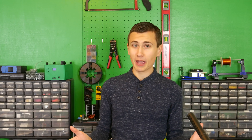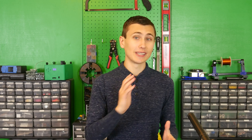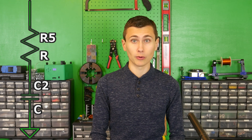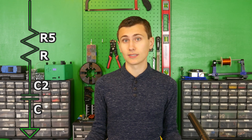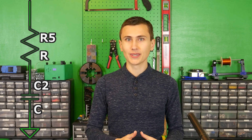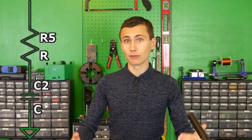It's Wild West time and there will be component overstress. What's this whole deal with the snubber anyways? How can it be broken? Why do we need to fix it? A snubber is a resistor-capacitor pair that dissipates power to limit voltage transients in a system. Ours is broken because it is not effectively limiting voltage transients.